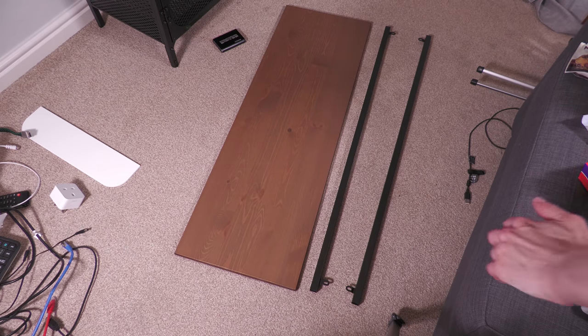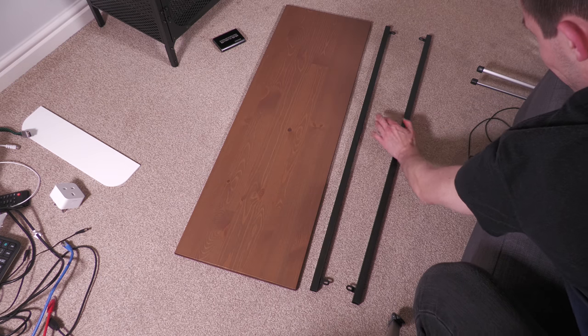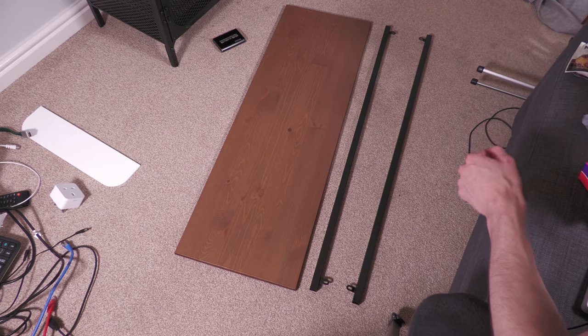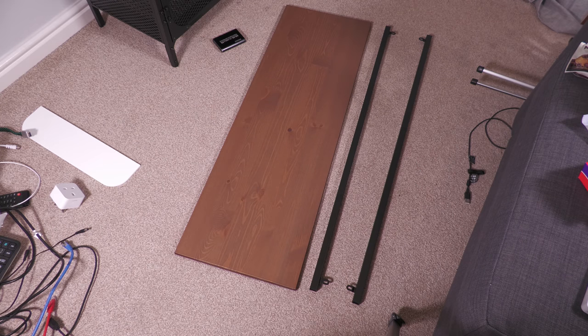And then if I did ever want to repair the cabinet and put it back together again, it'll be totally possible. All I would do is use some sort of steel plate inside the tube with a couple of screws through it, just to fix these two bits together. And then realistically, I'll just keep the offcut of wood and butt it up against it. And yes, there'll be a slight seam and maybe a slightly rough edge here, but if you strategically put that join where there's something sitting on top of it, it'll probably be okay.